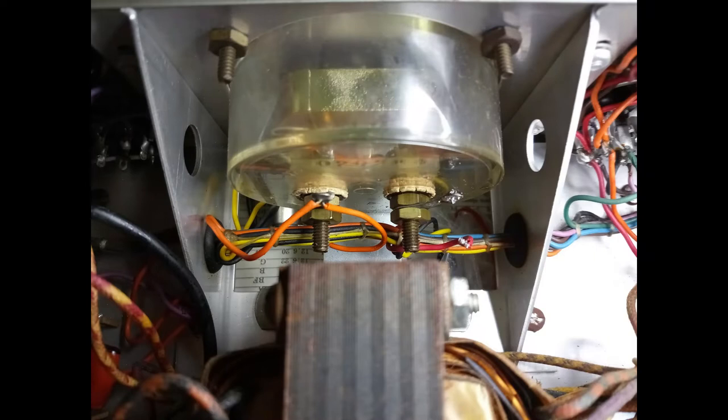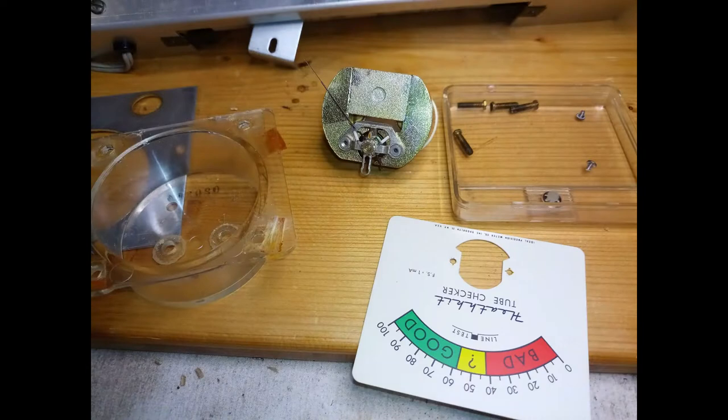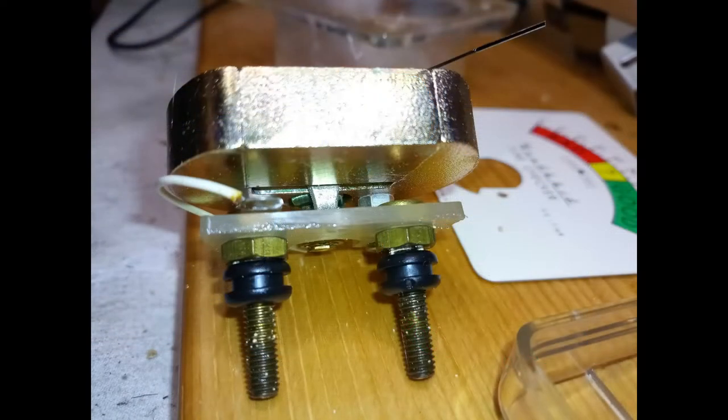While using the tube tester, somehow intensively, at a certain point, the meter started behaving in a strange way, resting off the usual central position, despite the correct line alignment. This behavior appeared while changing position to switches, which made all switch connections suspects, but that wasn't the reason for such behavior.